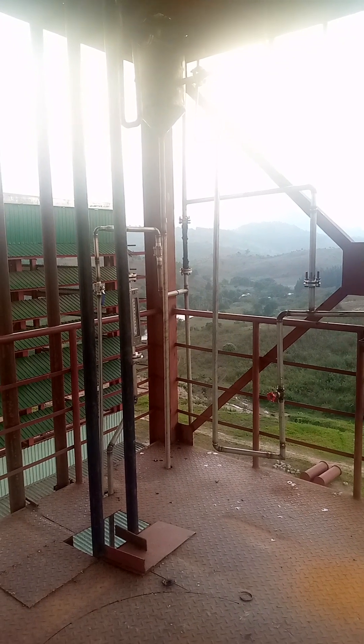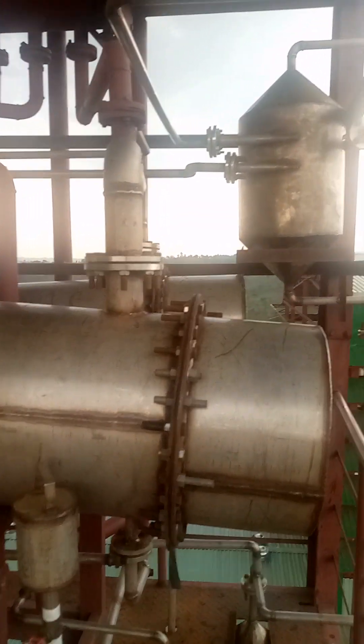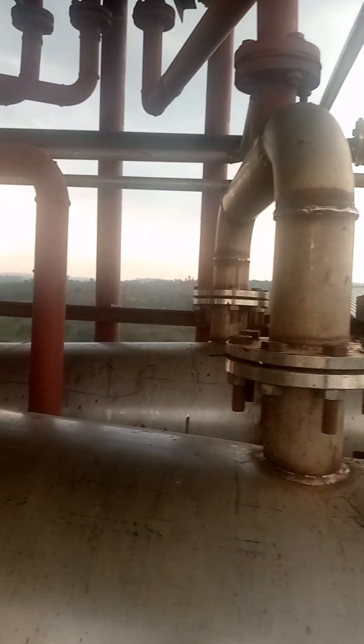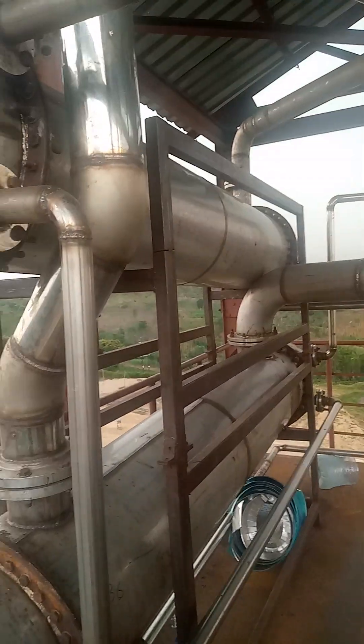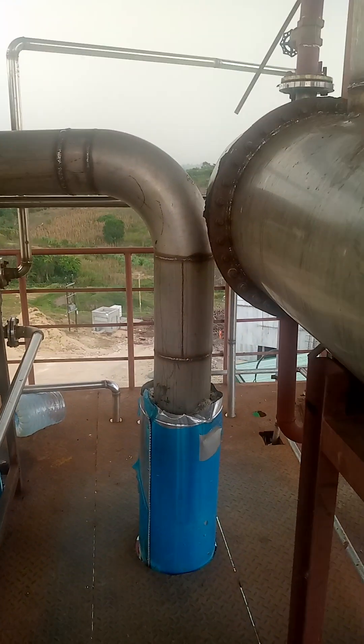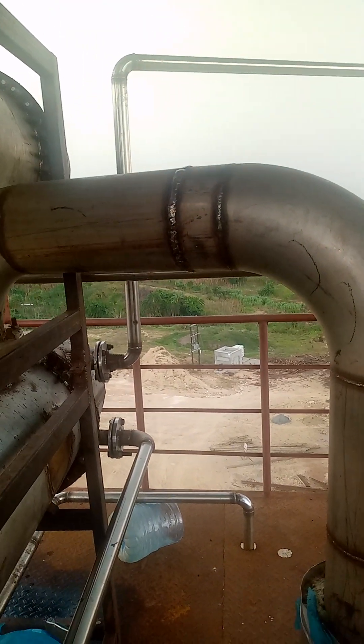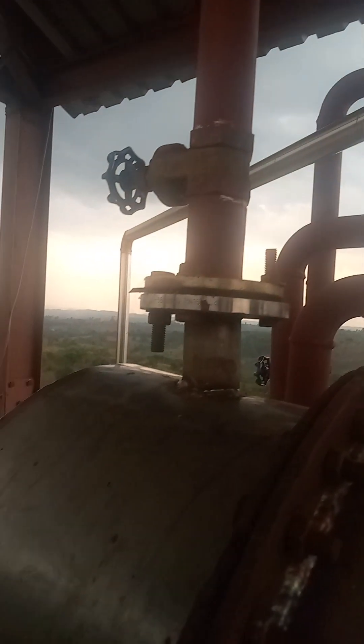We are going to look at the vent condensers — it has started raining but let me reach the condensers. This is the main condenser venting port and this is the vent condenser. You can see the water lines for the main and vent condensers. These two heaters are beer heaters of a total nine square meters. These are the vapors ascending from the rectifier top, flowing to beer heater one, then beer heater two, then the mash line enters and comes out going to the analyzer tower.